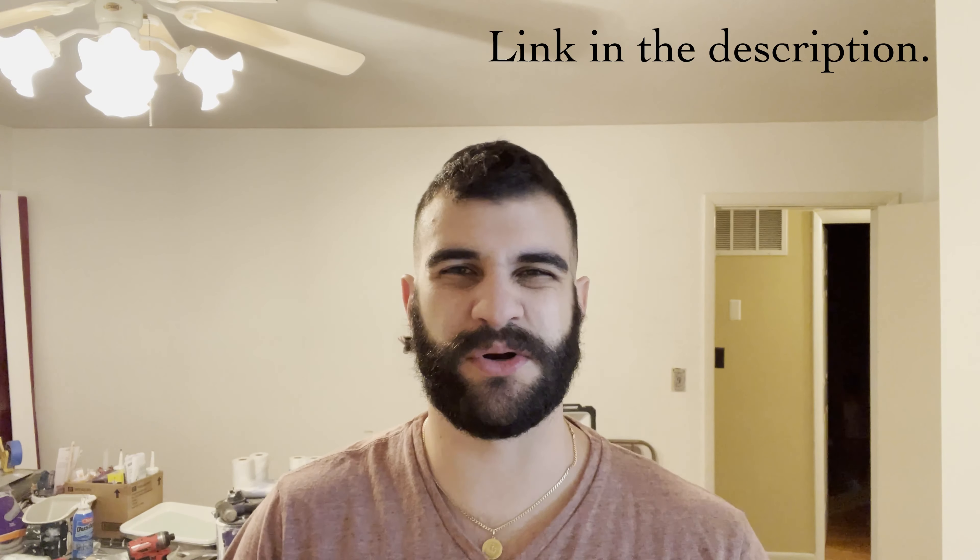So I learned that there are these little two check valves — one for the cold side, one for the hot side — that essentially collect grime and dirt and prevent it from traveling further through into the shower head or the handheld. So I'm going to take you with me on taking it apart. Never done it before, but figured it's as good as any. It's a specialty shower — rain shower head, mixing valve, and diverter.